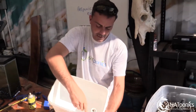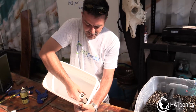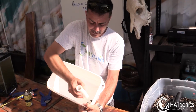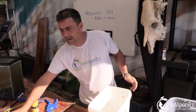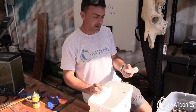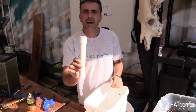So as you can see, as we manipulate this right over top of here, we're almost about 1/4 inch just below the actual standpipe or the center pipe, and this one just sits on the outside. And the reason for that is we want to provide ourselves a nice little air gap when we put our cap on. So the next piece here would be to take the outside cover of the siphon itself and put on our 1 inch cap.